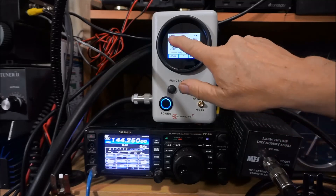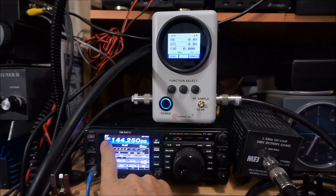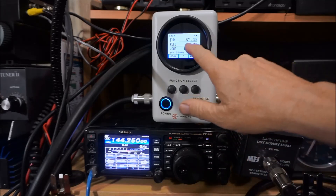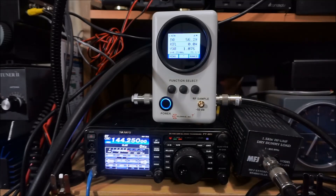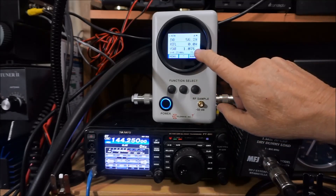I've left the 44D at C4FM because I'm going to use narrowband FM this time at 144.250 MHz. FM and C4FM are basically the same mode, just a little different in what's being sent, so it should give the same readings. Turning on the unit — it's at 50 watts because that's what it puts out on 144.250 — you see 57 watts, 0 watts reflected, VSWR 1.075 to 1.